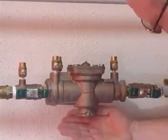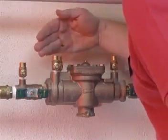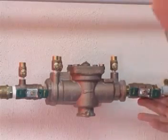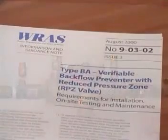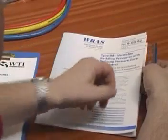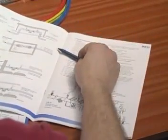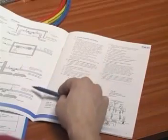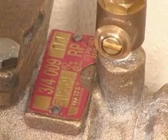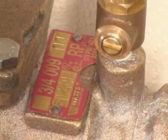Firstly, inspect the device and surrounding installation for any signs of damage or indications that it may have been tampered with. Also look to see if the discharge port is running or there are signs that it has been. Ensure that the installation complies with the latest version of the installation guidance note and that the clearances around the device are correct. Next, ensure that the serial number on the valve matches the device to be tested and that permission has been given to interrupt supply of water to the process.